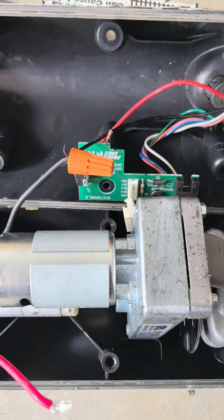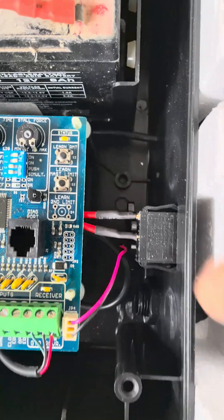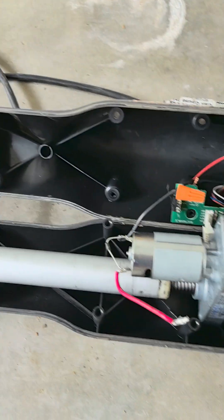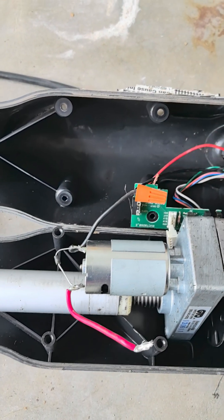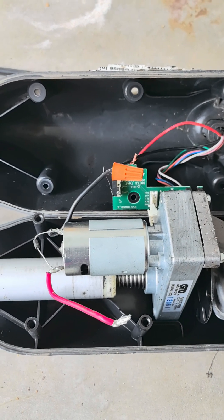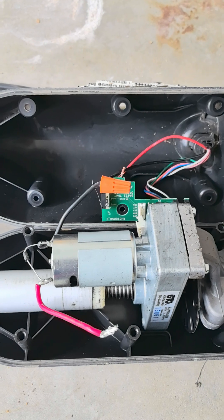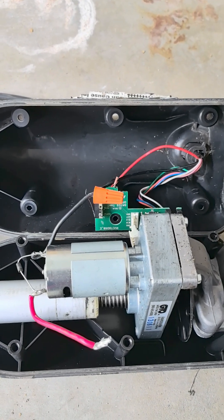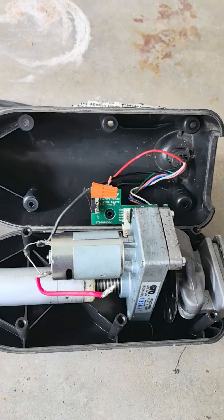You can click the master learn button — it's right here, called the learn. This is the master limit learn to set how much you extend your arm. You start from the fully retracted position, making sure this switch is pushed in so the motherboard knows you are at fully retracted. Then you extend out by clicking your remote until you have the desired gate position. This applies to a pull-to-open gate; push-to-open is a little different, but the general concept is the same. On the fully retracted position, this has to touch that — otherwise you'll get three beeps.